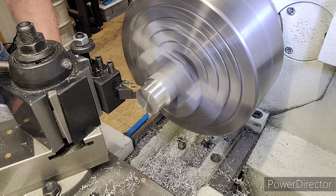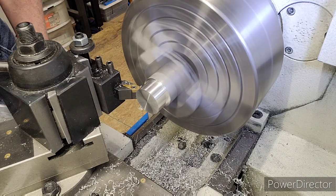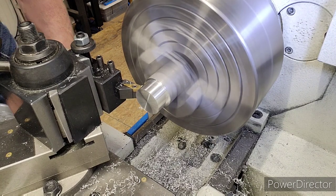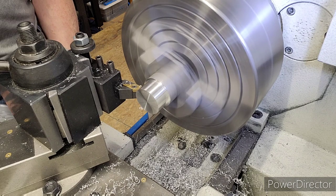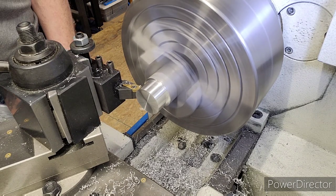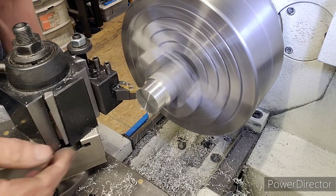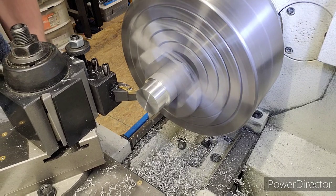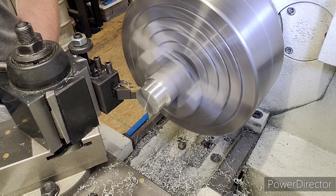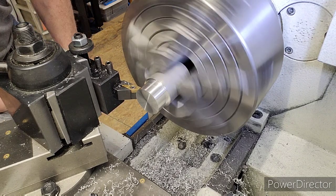We're going to come out 100 thou. Oh shoot, I went to 600. I wasn't supposed to go all the way to 700. We're going to have a really wide undercut then. I forgot I went 700 deep for clearance. So 600 is where we were supposed to go in for an undercut. I'm going to go to 600, so I kind of messed that up a little bit, I wasn't thinking. There's 600 right there. We should just do it anyways.